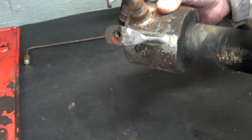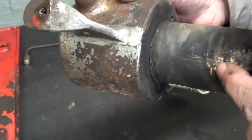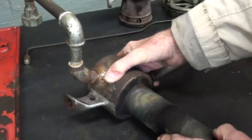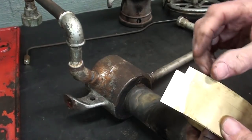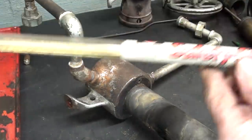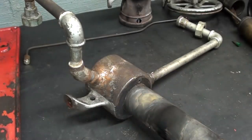Looking at the brass tube here, this is the area where I soldered it, and that solder melted out — it was hard solder that was actually pretty soft. So I'm going to clean this area up real well. It's also a little bit wrinkled there. I intend to take a tiny little piece of brass stock and make a patch, like an inner tube patch, and solder it on with that Stay Silv. This melts at 1370 Fahrenheit.